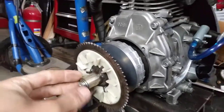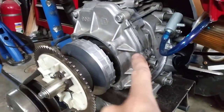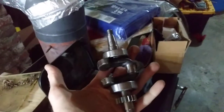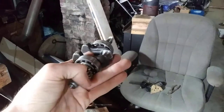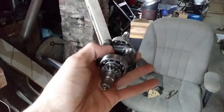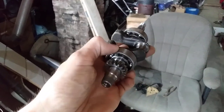Basically, there's so much force being pulled that way from this belt that it's worn out the bearing inside of here. It's not to the point where it's grinding or leaking oil, so it's still salvageable. But basically, there's so much force being pulled this way on this one spot that it's worn this bearing out a little bit. There's a little bit of play in this bearing right here.